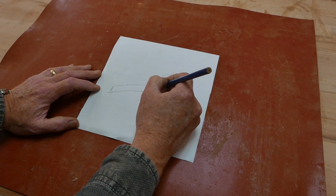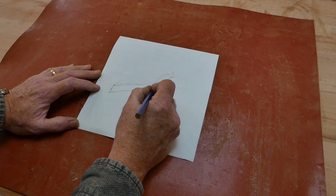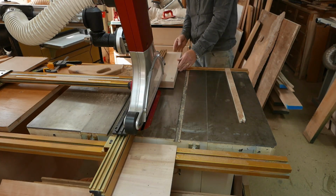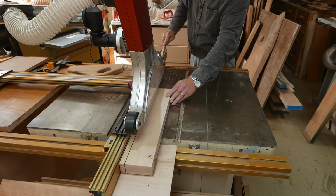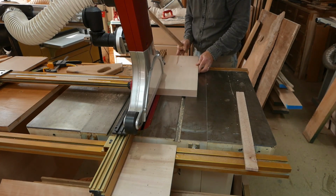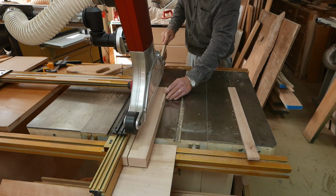I start this project, as I do all my projects, with an incredibly detailed, accurate to scale diagram using a pencil. With more detail than you can shake a stick at, committed to paper, I move across to the table saw and start slicing down some beech I found discarded in the corner of the workshop. I'm cutting the beech into 15mm strips, as it gave me maximum yield out of the timber I had left, and, well, it seemed like a nice number.